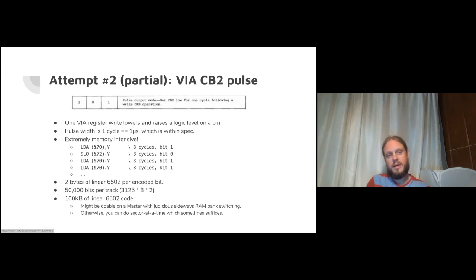And I did get it working. The trouble is, again, the CPU just doesn't have enough time to do a loop of getting bits together. So you just have to have this linear block of code that is writing to the chip, and that makes it extremely memory intensive. The best I could work out was 2 bytes of 6502 code per 1 bit of disk data, where 1 bit of disk data includes having to send clock bits as well as data bits. So when you calculate it out, that mushrooms up to about 100 kilobytes of linear 6502 code required to write a full track,